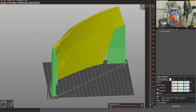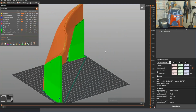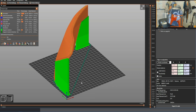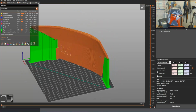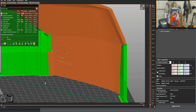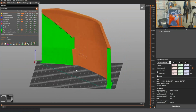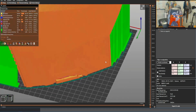Yes, there we go. That's what I'm talking about. That's what you want. Okay, now see, we've added stability. Now we've got contact. It's kind of gluing these. The supports are adding some reinforcement to the print to not only support these areas that are technically overhangs, but also to help lock the model to the bed. All right, we could do a brim here.